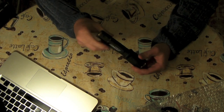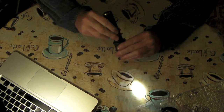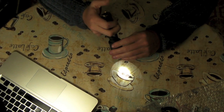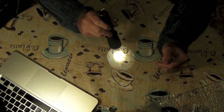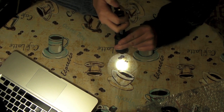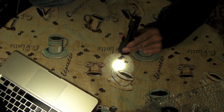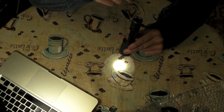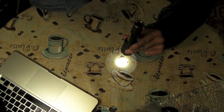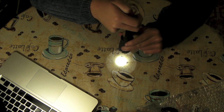Here's a demonstration. To enter general settings: bezel is loosened, turn the light on, tighten — as soon as it switches, loosen the bezel, then turn the light off and on. Indicated by one blink, I am in Item 1 of general settings. I'll cycle through by turning the light off and on — it'll be two blinks indicating Item 2, then three, four, five. You can see five blinks — I'm in Item 5 of the general settings.